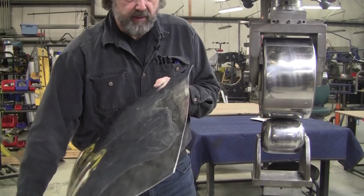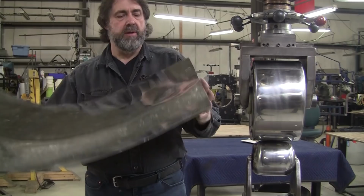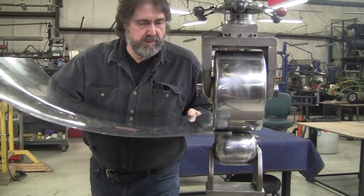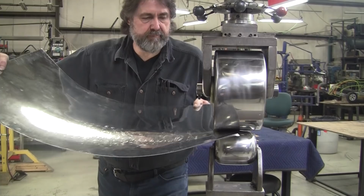And because of the wheel, we're working on this part of the wheel. It'll tend to orient this way, and we don't want it to orient that way. We want it to arrange this way. So if you're doing this stretching on the edge, you can do it preferably upside down, and that'll orient it the other way. So let's do this upside down. And when you do it upside down, you have to lift up on it also, like this. So that's stretching it out.